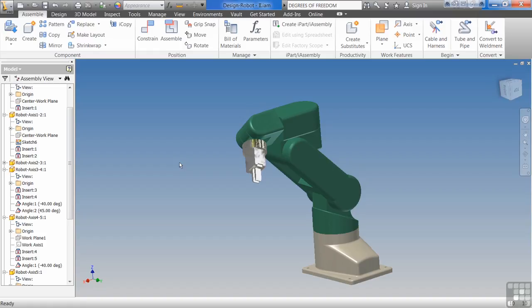What happens is you say, oh, this only has 3 or 4 or 6 constraints on this one part. Well, this subassembly has 10 parts, so that's 60 constraints. And then there's 100 subassemblies, so that's 6,000 constraints. And then there's 10 main assemblies, so that's 60,000 constraints. And then those all go into 4 big assemblies in 6 different versions. And before you know it, you're into the millions of constraints, lots of calculations Inventor has to do.